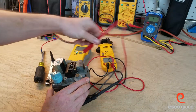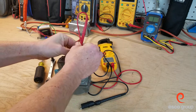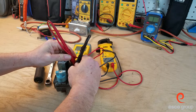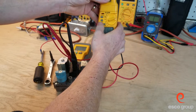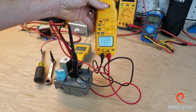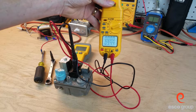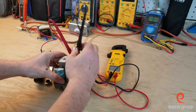If we wanted to test this coil, we would use the ohms function of the multimeter. I like to use the clips when testing for ohms because my hands are a little shaky and if you move them around, the reading is going to keep jumping. So let me turn the light on for you. We got about 94, 95 ohms. We're looking for a measurable resistance and this qualifies. So electronically, this valve is good.